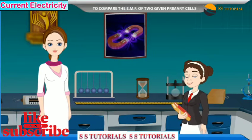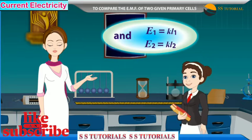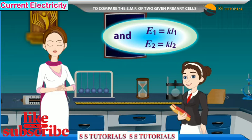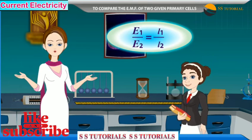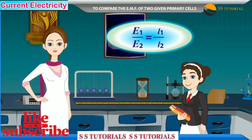If L1 and L2 are the balancing lengths on the potentiometer wire, corresponding to two primary cells of EMFs E1 and E2, then E1 = KL1 and E2 = KL2. Therefore, E1/E2 = L1/L2.